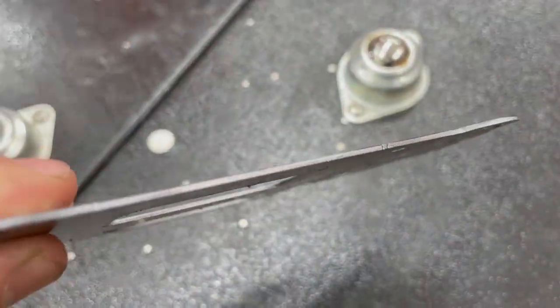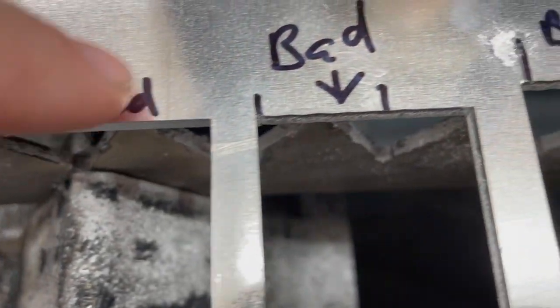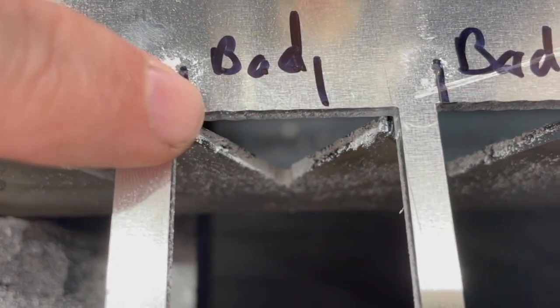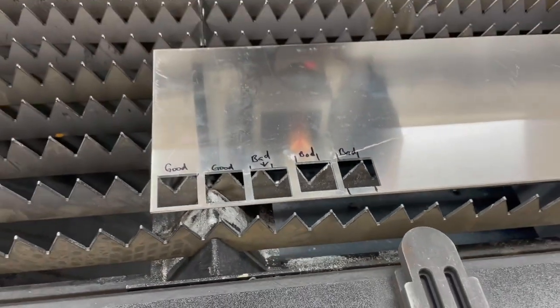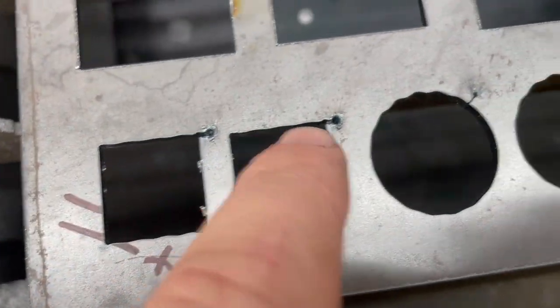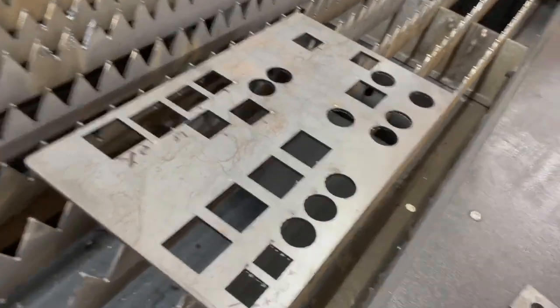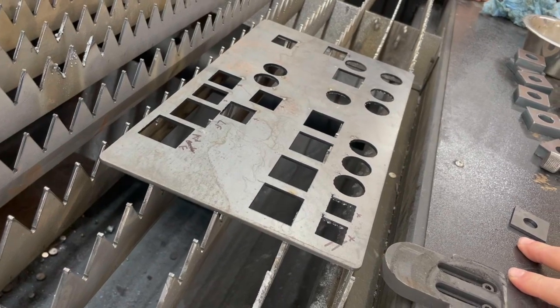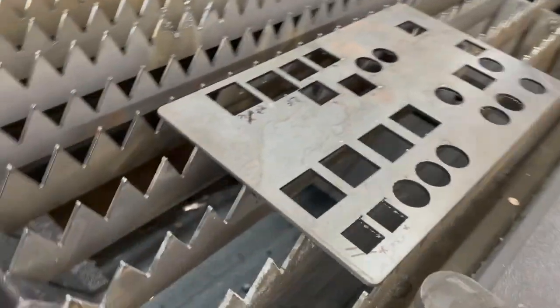Here's another little weird problem we were having — getting some wavy cuts in certain places. We took the motors off, double-checked the gear rack mesh, the coupler for the motor gear to the shaft — everything looked perfect. But we were fighting this issue and could not resolve it. What it turned out to be, after lots of taking stuff apart, is with compressed air it was shaking the line just enough that you couldn't really see it. We put a clamp on it and cut all those wavy cuts out.